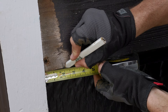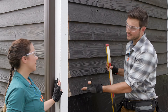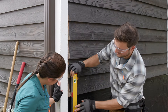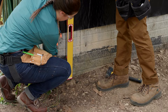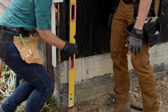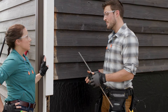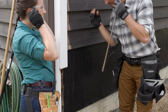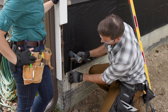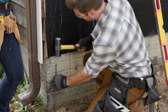I'm going to go ahead and make this mark right there at two inches. Now we want to transfer that line down to our foundation, because our stake isn't going in right here. A great way to do that is to take a four-foot level — I'll level this out and have you make a mark by the foundation. Now we're ready to drive in our first stake, following the same process on the next corner. We want to keep this as plumb as possible.